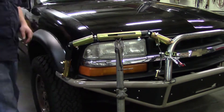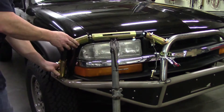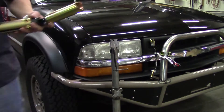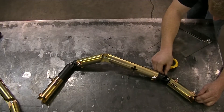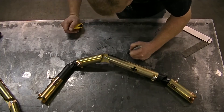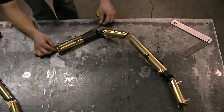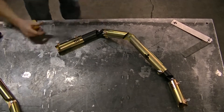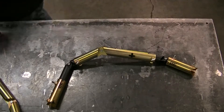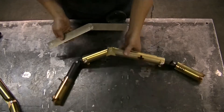Last I need to lock down the tube jig and tighten the hinges so nothing moves while it's on the bench. Then I can grab an angle finder and measure the final cope angles, and we're ready to put it on the bench and copy. Now I can measure my final numbers, starting with the distance from the cope to the bend, then from in between each bend center line. I like to write these down so I don't have to remember them. On the final cope-to-bend distance I'm measuring to the long side of the cope, because that's where the tube notcher starts. Next I want to measure bend angle by using an angle finder and holding it against the jig, then lining up to the other side of the jig.